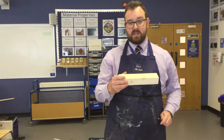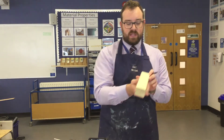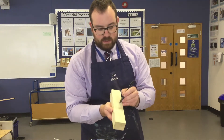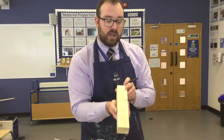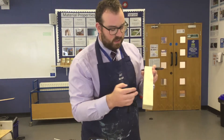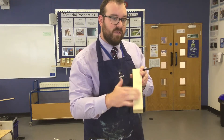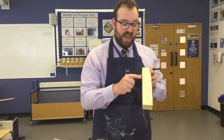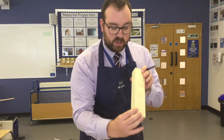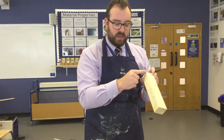I'm going to use a black pen so you can see it more clearly on video, though you would always use a pencil. This face is now going to become my face edge — my accurate face. What I do is literally make a little squiggle like that to mark it. This apparently comes from the Latin 'facio', which means face, and it's just a little squiggle carpenters use to identify the most accurate face. Then I twist the timber and put a little arrow to mark the face edge — so I know which edge goes with this face.